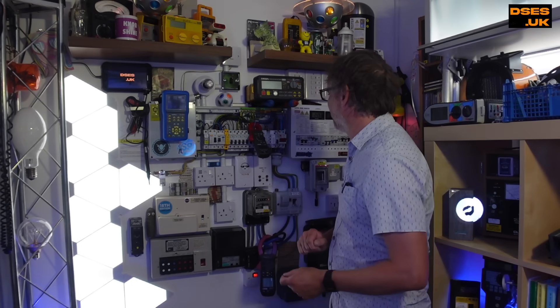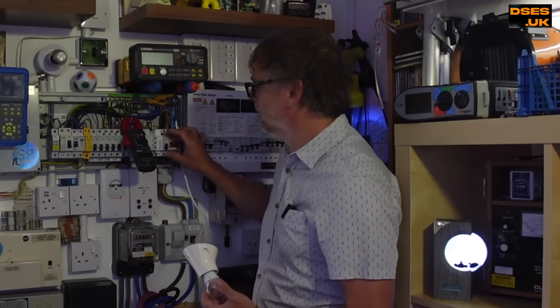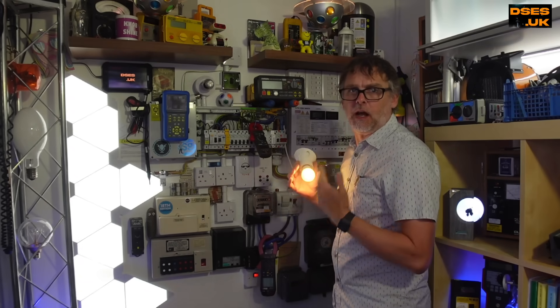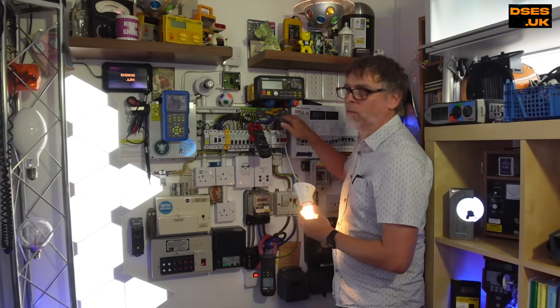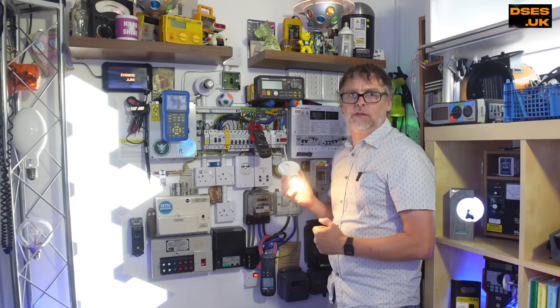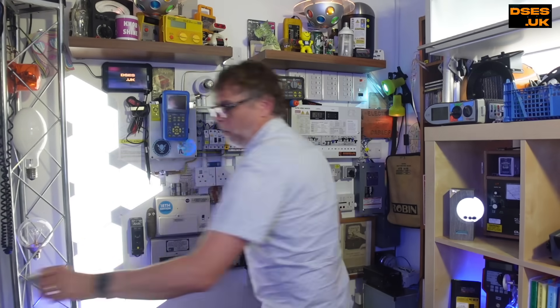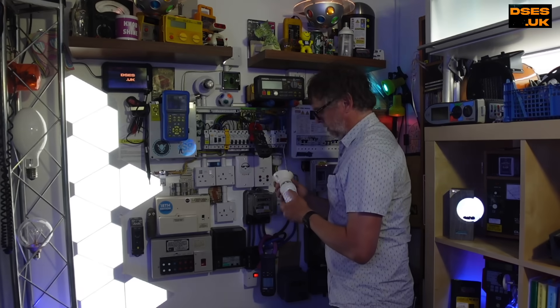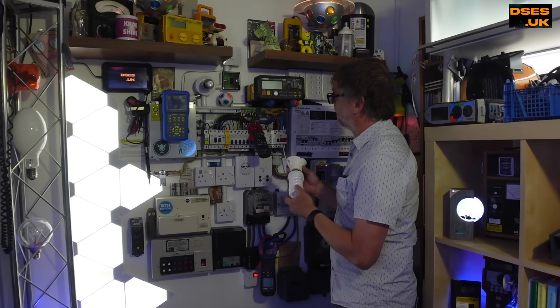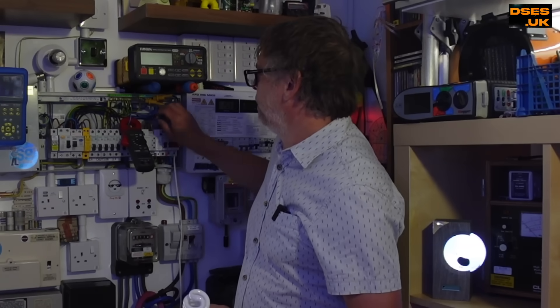Let's stress it a little bit further. This LED lamp is nothing to do with my RCD or its dependent circuits — instead it's powered by the MCB in this circuit way which lacks leakage protection. If I power this lamp on, its return current is split over the RCD neutral and earth because of our resistive fault between our two bars. Most of the current is going to be flowing down the earth, but some of it is going to be back-feeding through the impedance of my RCD neutral. If we up the ante by sticking in something slightly more powerful — like this CFL lamp — we should probably stress the RCD enough that it trips off. There she goes. Leakage current being back-fed via a neutral-to-earth short is one way you'll find an RCD tripping under apparent no-load conditions.